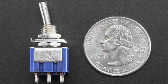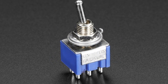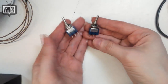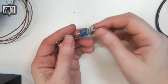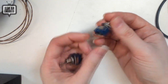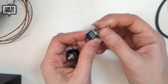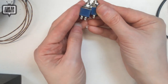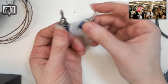We have two mini toggle switches. John Park actually requested them and I was like, yeah, good point, we should probably get toggle switches. So we did — that was a couple months ago and now we have them. There's two kinds. They're both toggles: single pole double throw, but one of them has two switches in it, so it's double pole double throw. They're very small and compact, which I really like. They're basically meant to be panel mounted — they come with hex nuts, lock washers, and mounting nuts. They're rated 6 amp, 120 volt AC, but honestly I wouldn't use them for more than like an amp or two and maybe 24–30 volts, because I just haven't been able to test them at such high voltages. If you're using something at high voltage, get pretty beefy switches. One has two switches and one has just one. They're very satisfying to toggle.